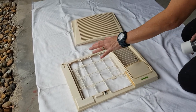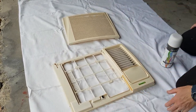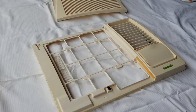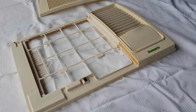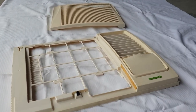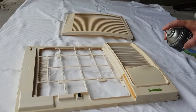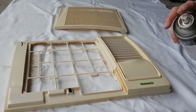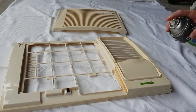We're just going to paint the top part of it. When you spray paint, make sure you're somewhere well ventilated but not too windy. Always give your spray can a good shake, and shake it a few times even during the job. When you're spray painting, don't stay in one spot for too long — just nice passes over it. You're better off letting it dry and coming back for a second coat than focusing on one spot too long, or you'll end up with big blobs.